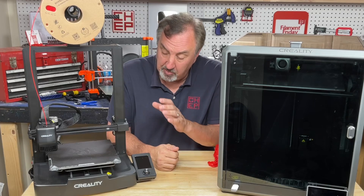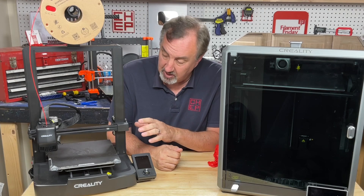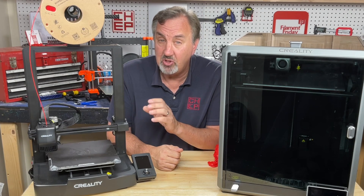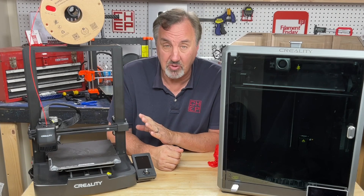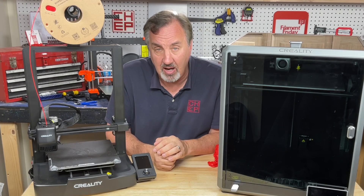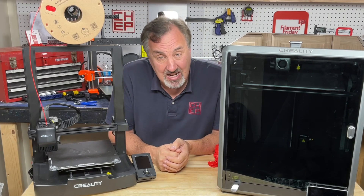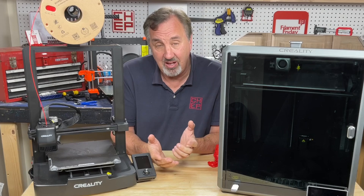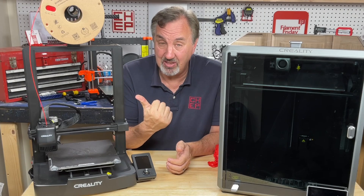If you've watched my channel recently, you know I'm a big fan of the new Ender 3 V3 SE. This is a huge upgrade to previous Ender 3s. It's got an excellent auto level system plus a strain gauge which does automatic Z offset, so you get perfect bed levels right out of the box. It's real easy to assemble and it's got some nice features including direct drive. It's $199, so it's a great starter printer. This guy is $899, so you could buy four of these and still have money left for filament. But this thing prints fast — twice as fast. It's got a much bigger bed so you can print bigger things, and it can print temperatures up to 300 degrees C, so there are definite advantages to this over the Ender.